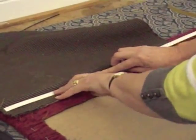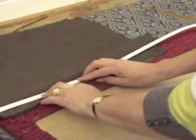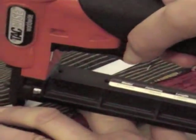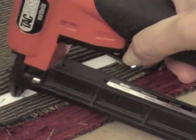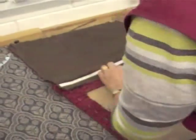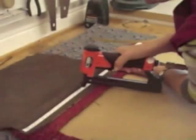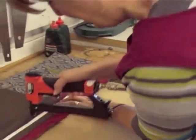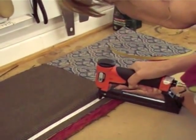You need to push that tight onto the line where you want the fabric to turn over, because it will give you that sharp edge. If you're doing this with staples, it's best to slant them so that you're getting it fixed tightly and fixed as far from the tack as possible. It can also be done with tacks — there's nothing to stop it being held on with tacks — and you want to space them about half an inch apart.